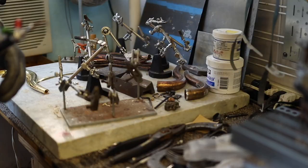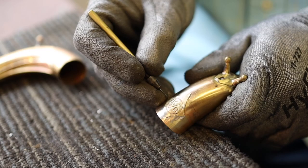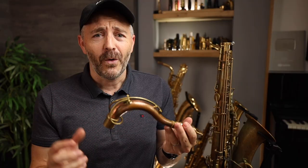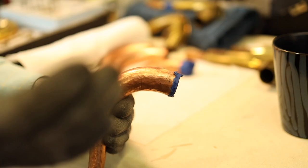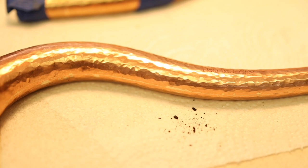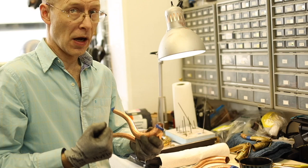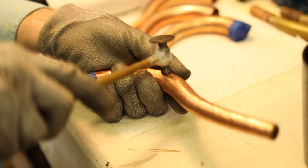This process, done by a master craftsman by hand, is what makes these necks special and sets them apart from a lot of the mass-produced but branded saxophone necks out there. Once the halves are fused together, it's time to get the hammer out. Pure copper is a soft material and would be more prone to pull-down damage, but by hammering it you are compacting the material and making it a lot stronger, so there's no risk of pull-down on the neck.